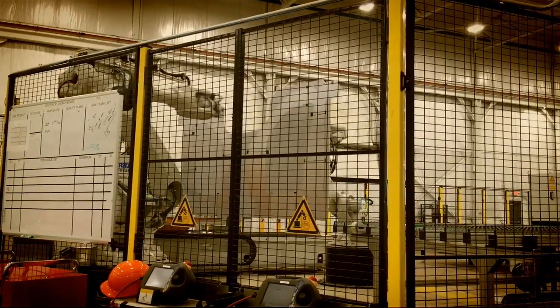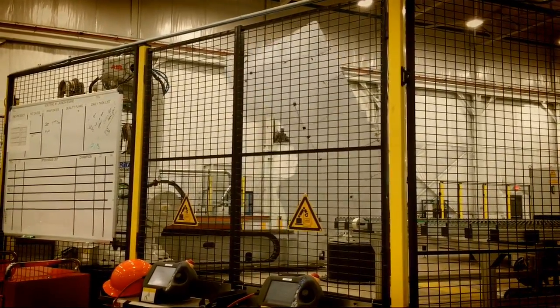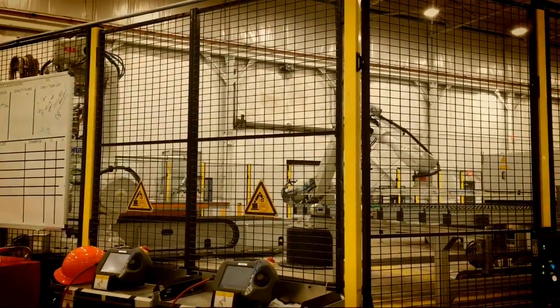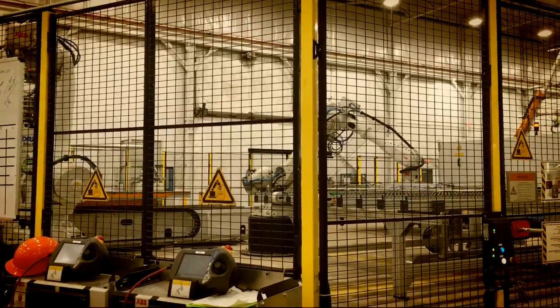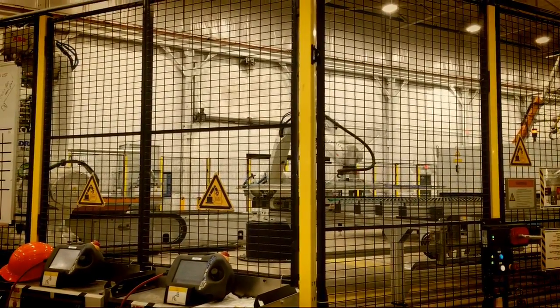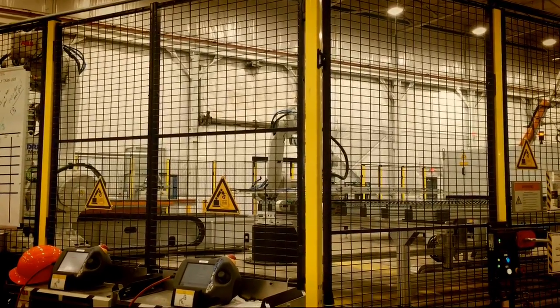In the seam tracker, what we'll do is take a series of pictures — hundreds of them — and it'll find the average gap between the parts, and run the laser right up the gap. Then there's the inspection camera that goes through — that's the third screen in. That camera goes over the weld and reads things like gap width, height.